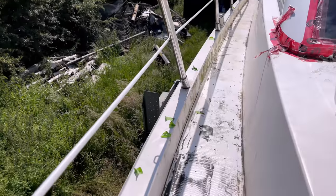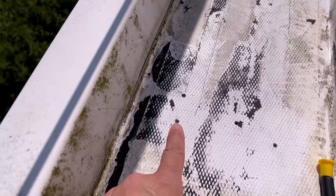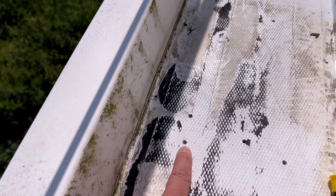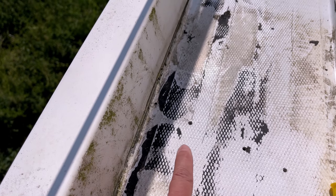Okay guys, excuse the wind noise, just up on the deck here. So you can see that these holes are now filled. So we're just gonna let these set up, and then we're gonna have to leave them overnight. And then what we'll have to do is just clean the amine blush off these, give them a quick sand, and then we'll be able to fill that with gel coat.